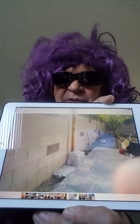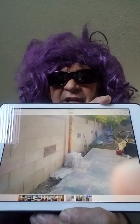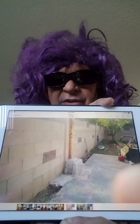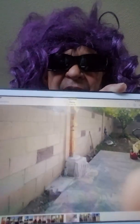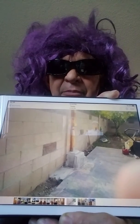Now what was cool was it took about 3 days for that concrete to cure, and the jacks dropped off because the concrete cured and the tension relieved off the wall. The concrete block took all the tension, and so I'm level. It's done. I'll show you if you can look closer at that. I got the drain pipe below it, the pins for the rebar, and the block wall is level. Let's see if I can get a picture for you here.